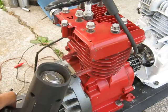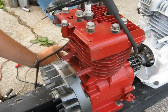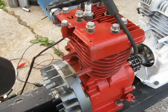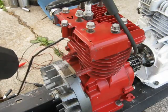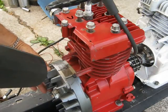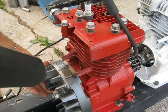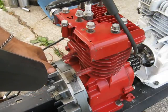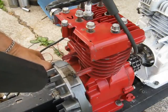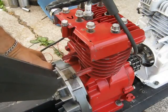I've got my timing light here all wired up and my ignition system powered up. The good thing about an old points-type system is they'll fire at practically zero RPM. It's going to fire somewhere in this area here, just before top dead center. Right there — right around the top dead center mark. As you can see, I can turn it very slowly.